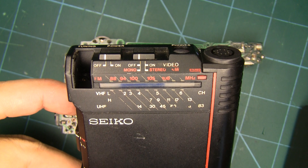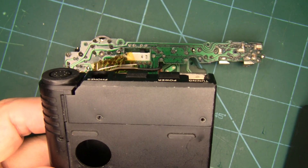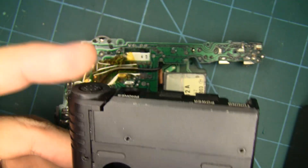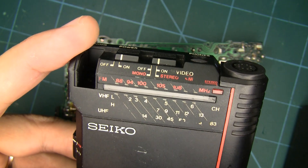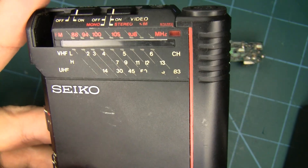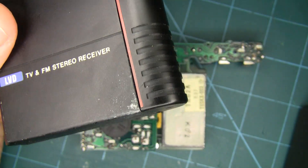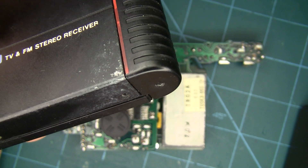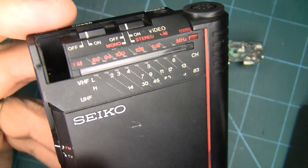As you have noticed, this is a TV FM stereo receiver from Seiko for the Seiko TV watch. The model number is TR-02-1, you can see it here. The seller mentioned there had been some issues with the audio, and since there is no analog signal anymore you cannot test the video capabilities. But there are some signs it was partially working — one of them was this corrosion here, typical of aluminum corrosion from a battery leak.